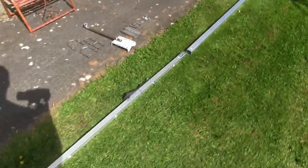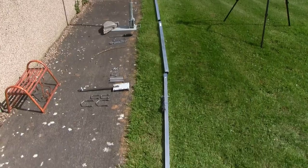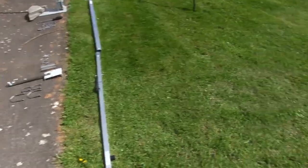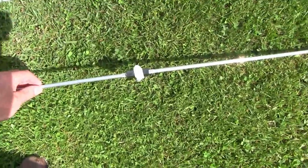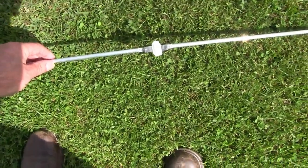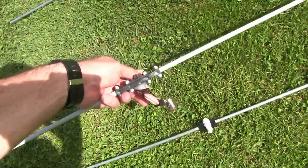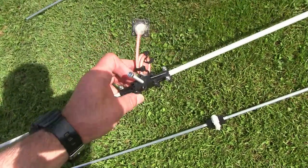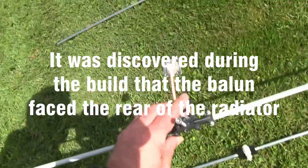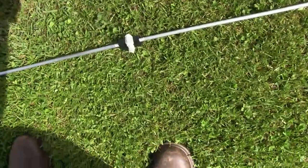There is the boom laid out, and that's not too impossible for a one-man portable operation. The elements are also numbered. Element number one has a 1A and a 1B on it, so we keep all the A's down one side. Pay attention to which way round it goes because the A here goes forwards — meaning the A's are all on the right-hand side and the B's all on the left.